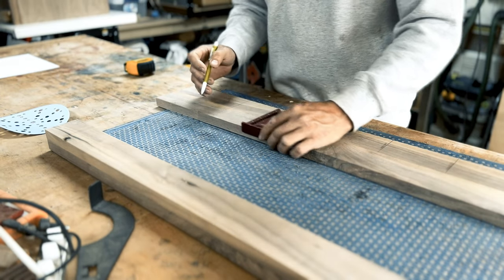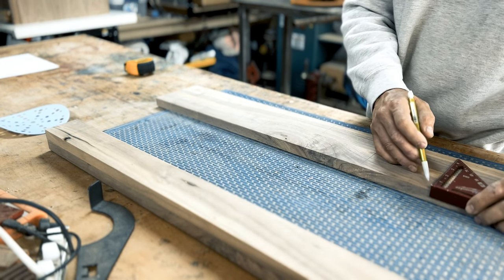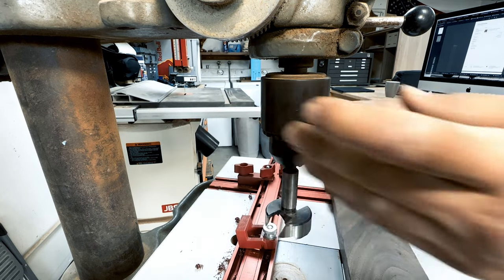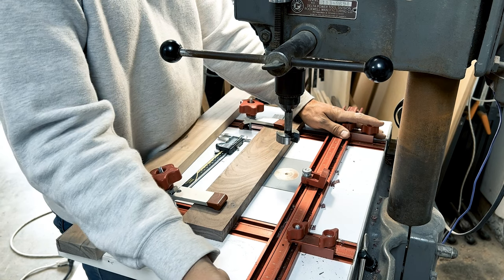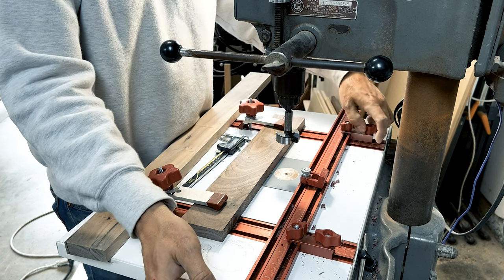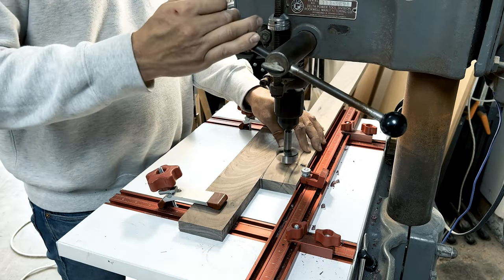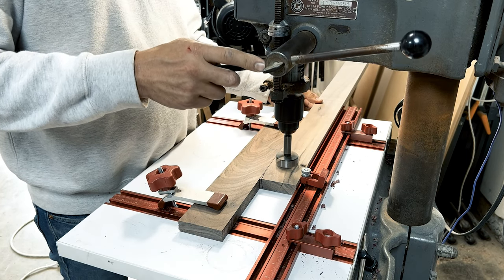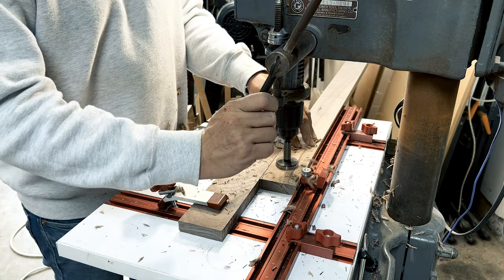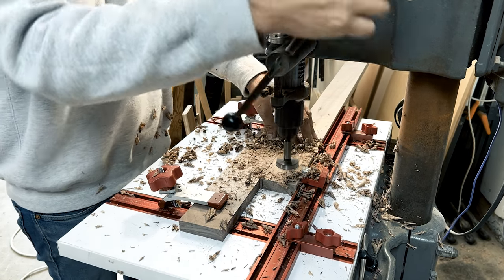You will use this piece as a story pole for your other piece so they match up perfectly. The bit you should be using is a one and five-eighths inch Forstner. You're gonna want your fence one inch and seven-sixteenths from the edge to the center of your drill bit. Set the depth even with your drilling surface. When drilling your first hole, use it as a test — your depth should only be to the bottom of the material, not any further, or you'll blow out the backs. Go slow and make sure your depth is correct.